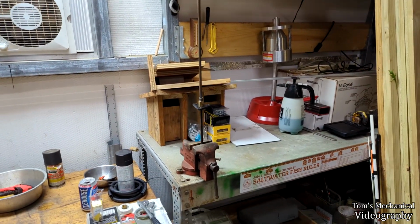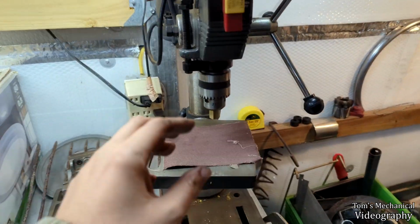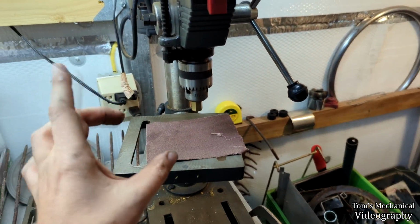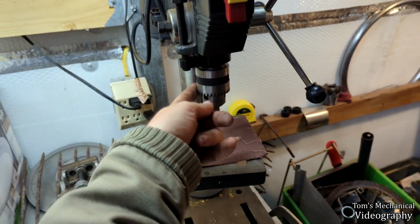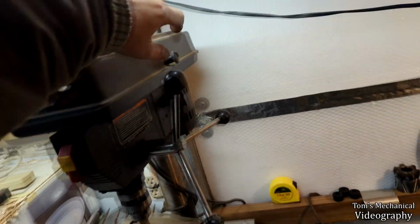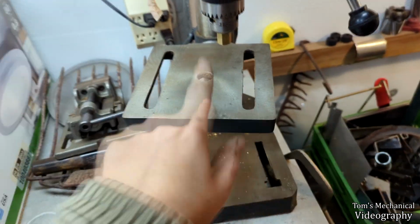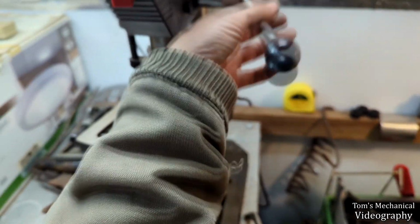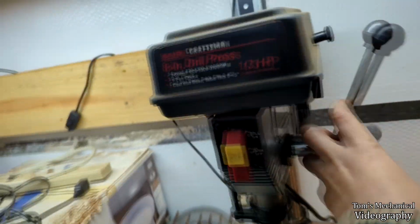I think we're there. Alrighty, so here's my harebrained idea. I found a 1/2 by 20 plug, stuck that in the top, because that was small enough to then put into this chuck. And then I've got this drill press set to its lowest speed. And then I've got this plate set, well, not exactly, about a 1/16 of an inch from the bottom.